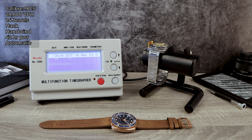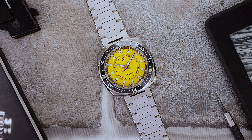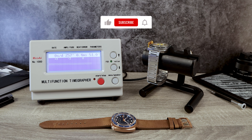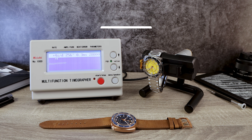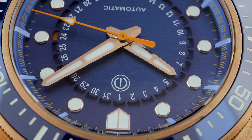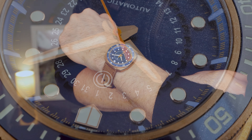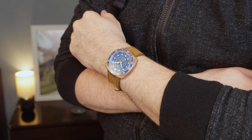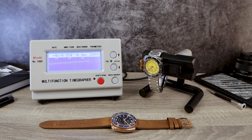So what's powering the Cuttlechron? It's the Miyota 9015. It's a 24 jewel 28,800 VPH hack hand wind automatic and it's got 42 hours of power reserve. This movement is quickly becoming the standard in the industry as micro brands start to skip the NH35 Seiko option for this much better movement. And for those of you who may not know, the danger zone for changing the date is 8:30 PM to 2 AM on the 9015. It's officially rated at negative 10 to positive 30, but it looks like MMI is regulating these, which is awesome.